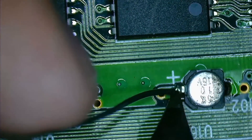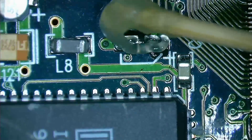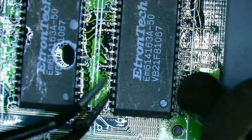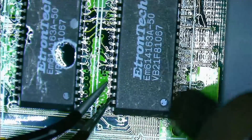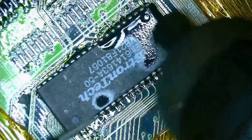Time to get the soldering iron out. I will start by removing all aluminum electrolytic capacitors. Many of those caps look beaten up, and I need to figure out which ones I can salvage, since I don't have enough spares to replace them all. I will check each of them with a multimeter to determine their capacitance and pick three that are closest to their rated value. After removing the capacitors, I can proceed to use hot air to carefully remove the memory located near the TMU chip. There are four to five pins that are badly corroded on this last memory chip. Removing it requires extra caution, as the corrosion may have weakened the pads on the PCB, increasing the risk of accidentally tearing them off. I make sure the solder is melted properly before moving the chip aside, then move on to removing the remaining three memory chips.